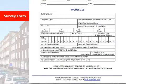If emergency power is present, we have to know that, because there are times, with certain elevator systems, where we have to add an extra panel to deal with the emergency power situation. It doesn't happen often, but it does happen, and we have encountered this on numerous occasions where we've had to send a panel out, delaying the job, getting the mechanic off, bringing them back, to install the last panel because we didn't know going in, even though the print may show emergency power, that it actually existed. So that's a key question.